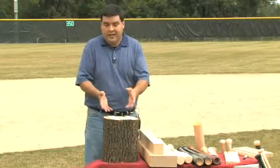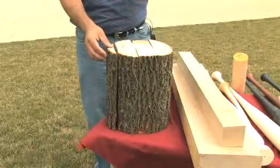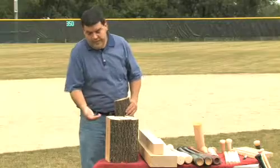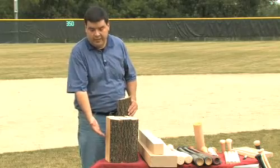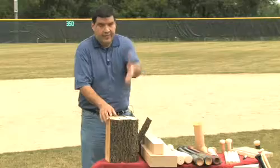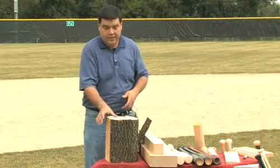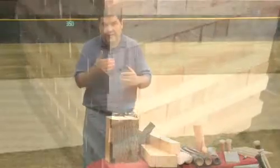What I've done here is I've actually cut it up very similar to how it's cut up in the sawmill. They make a first cut to open up the face, and from there they can tell what quality of wood they have in this log. Their first cut is always trying to be very parallel to the outside bark. Their next cut is a three-inch cut, slightly over three inches, and then they have a large slab that looks just like that.